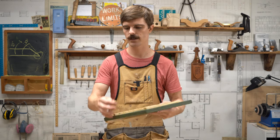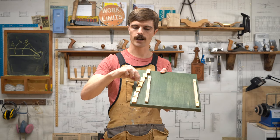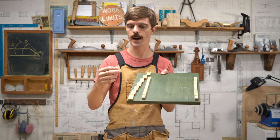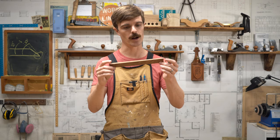There's one more piece — a little tiny stopper that you put up against these protrusion guides, which adds about two degrees to your blade when you want a micro bevel. Dimensions don't matter that much except for the thickness — this is precisely one eighth of an inch thick, which is important to get right because it adds a certain amount to your angle when sharpening. I have a nice piece of sapele from my shoe rack project that I'm going to use for that.